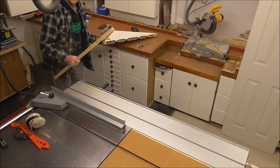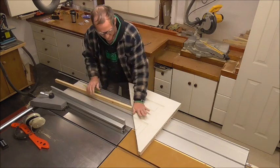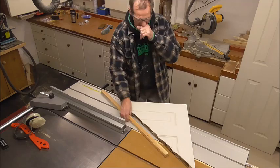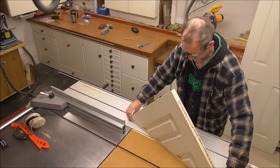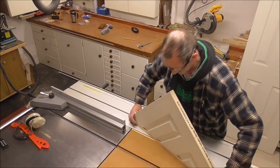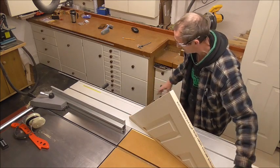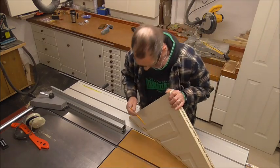Just check that - make sure it's a good fit. Good, snug fit. Now what we want to do is carefully mark those scallops. You want to make sure that these are balanced because you've got the 3mm hardboard on both sides - you want to keep it on both sides, or you'll be scalloping too much out of one side and nothing on the other.